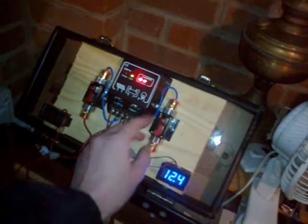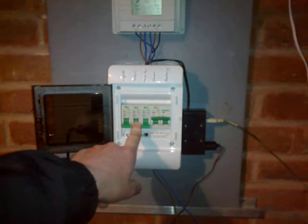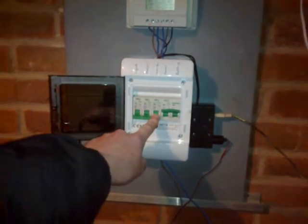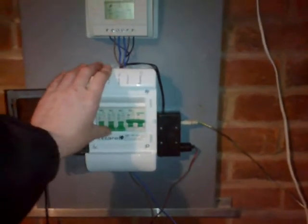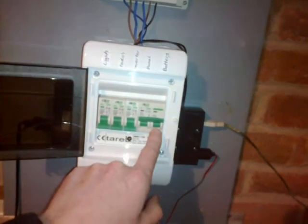I've got 12.4 volts in there and that turns on the power out. I'm piggybacking off that for power at the moment. There's a 10 amp fuse for the outlets, a 32 amp breaker for the inverter, and a 6 amp for lights. It's a double breaker for the battery bank and the solar panel — if the battery trips out, it'll trip the panel too, because you shouldn't have power going into a charge controller without the battery. And for any maintenance, you turn them both off and know it's safe.